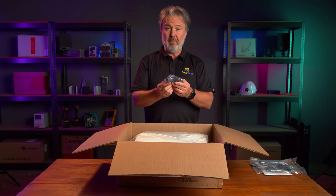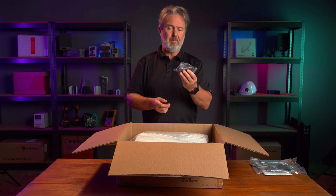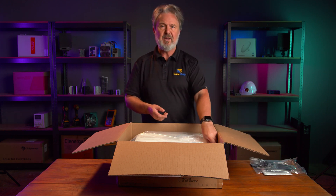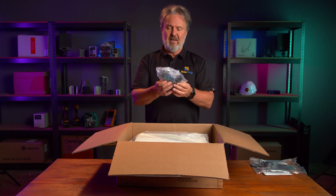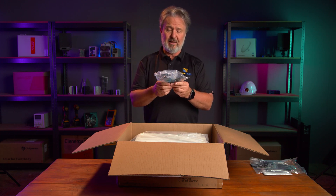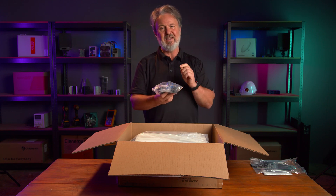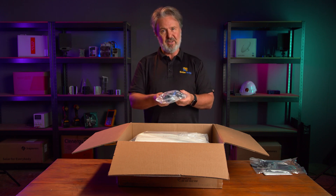All our DC connectors for our PV array — it's a dual MPPT, so we've got four plugs and sockets there. The AC connector is an IP67 locking connector that clicks in, and you've got to use a tool to unlock it. It even comes with a small Allen key for the Allen screws to tighten up onto your cables.